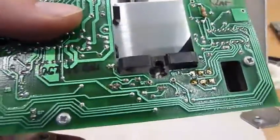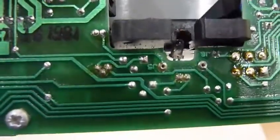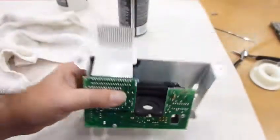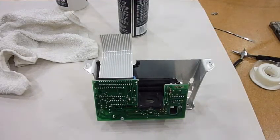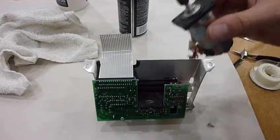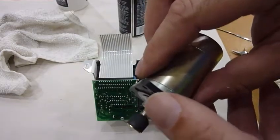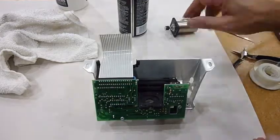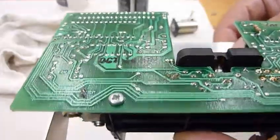The motor and tape I tested with 12 volts and it turned fine. Then I tested the lamp leads — the lamps are on the motor. Those leads right there, this is actually the lamp, and the photo transistor is on the other side. The lamp leads were about 10 ohms, so the lamp must be working. The photo transistor looks like it's aligned properly.